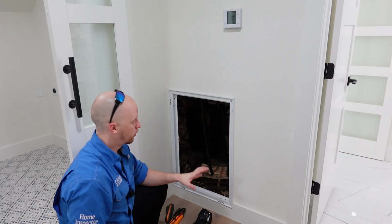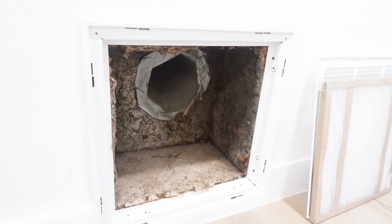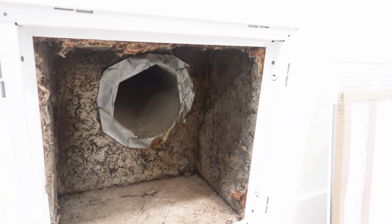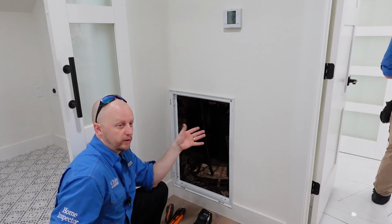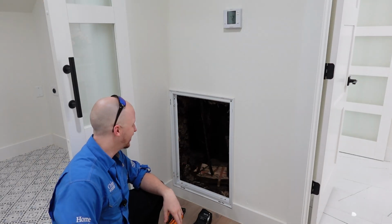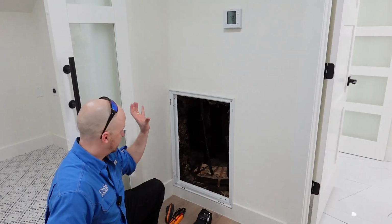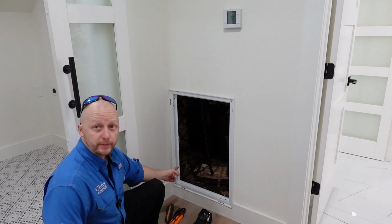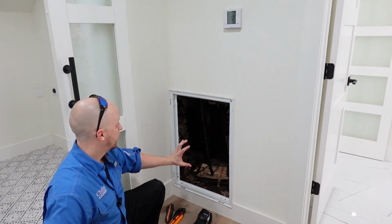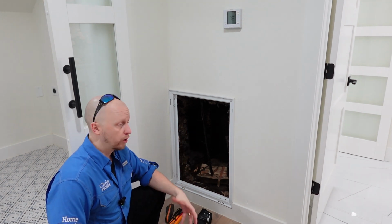I brought this up before, but whenever you're buying a flip home, you always want to open up these air registers. These air registers are going to be one of the last places that they renovate, even though they should do it whenever they have all the sheetrock down and whatnot. But in here, you can see that this air register is cooked. It's gone. You can see it's fallen apart, it's degraded. We have an electrical wire that appears to be open through the system. And also you can see a mold-like substance growing in there.